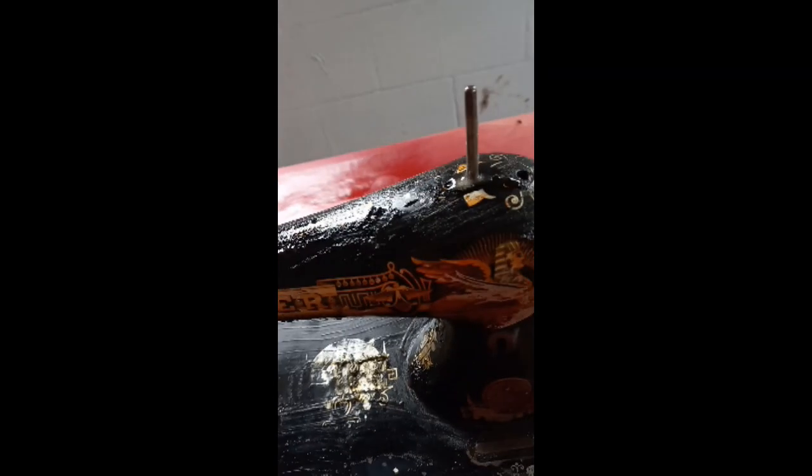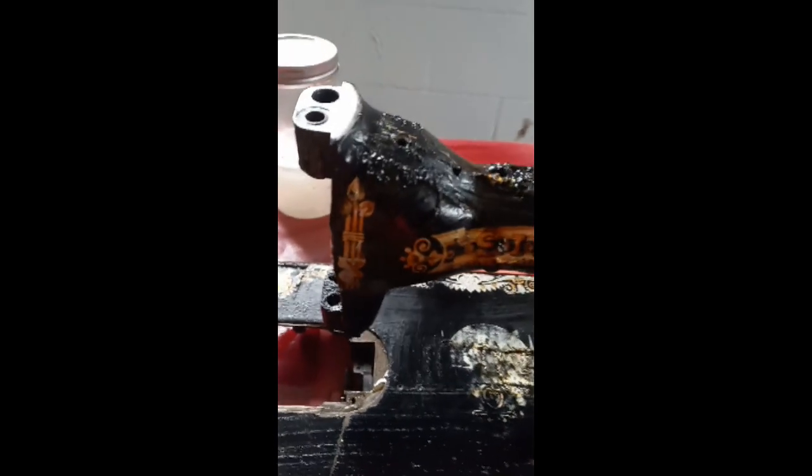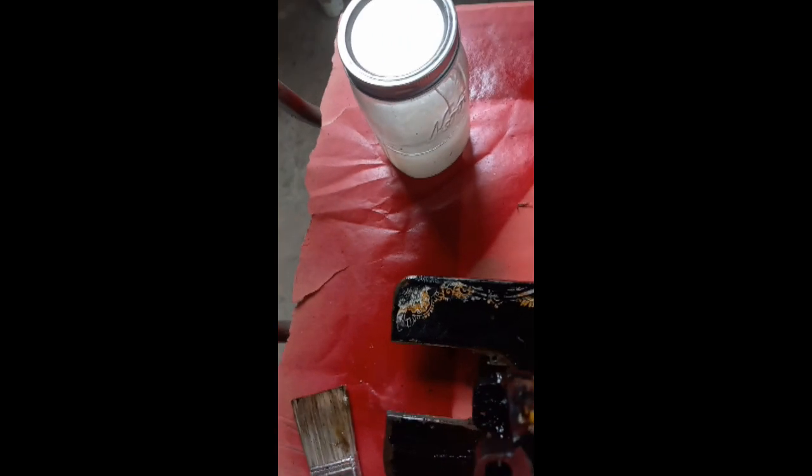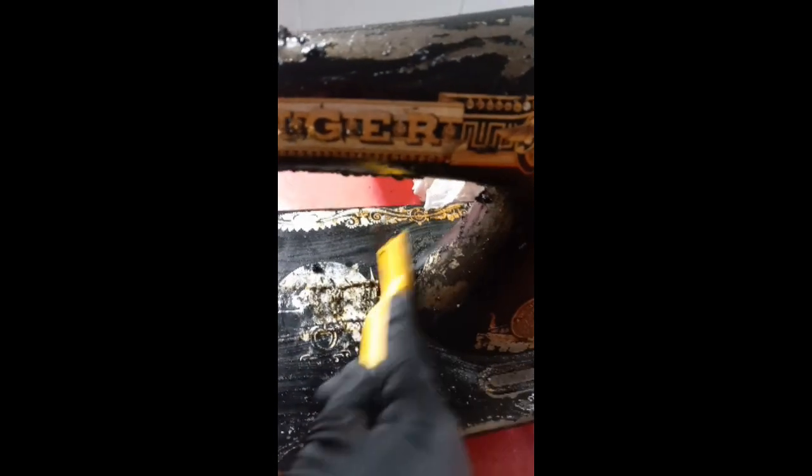It's been 15 minutes. I put on one of my gloves and you can see paint is already starting to bubble up. It's going to take several attempts, but on the top just this one pass is able to get down to the main layer. Sometimes it takes five or six different layers to go through. I've got my steel brush — I have a brass one too which is a little softer — and I just go around everywhere that I put the stripper. I rub the wire brush over it just to loosen up everything that can come loose. I'm not pushing really hard, just rubbing. On this machine it was so bad in here — I actually put some stripper on this part and I think that's going to help.